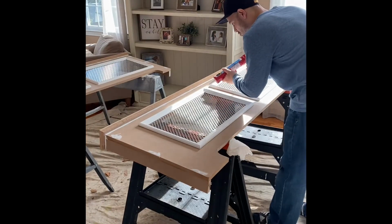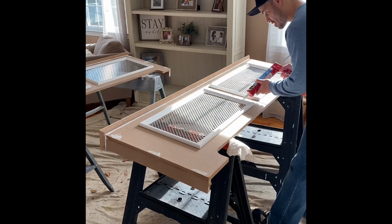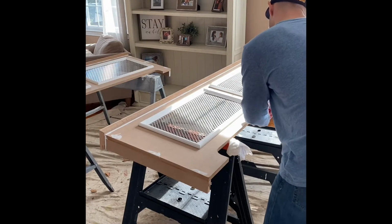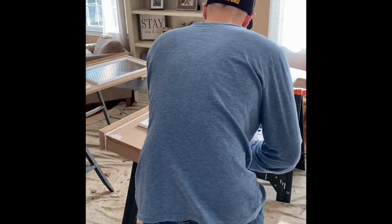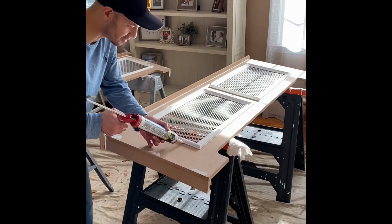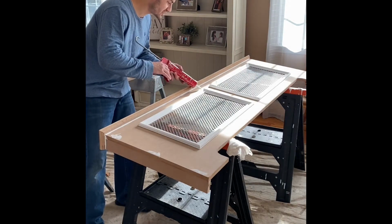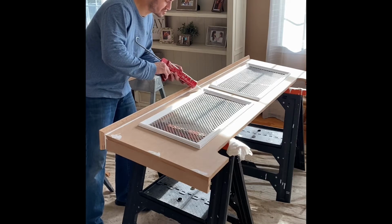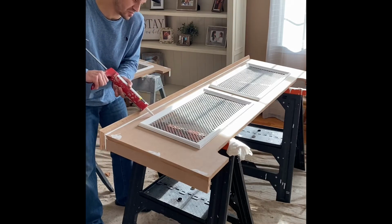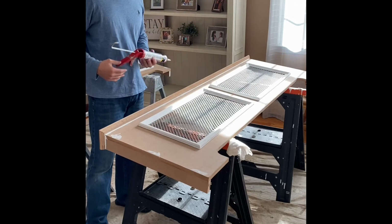Well, I can't stress enough the importance of proper prep and finish work before you want to stain or paint your product that you built, shelving, furniture, whatever that may be. We all hate this step, but applying a proper caulk, proper putty, gluing all your miters before nailing them, those steps are so important, especially living in New England. There's drastic temperature changes throughout the year, not to mention humidity changes. So you spend all this time building a beautiful piece of furniture or woodwork, only to not prep it properly. 6 months to a year from now, it's moving on you, expanding, contracting, just looking like crap. You're not happy, the customer's calling you back. So again, I can't stress it enough.